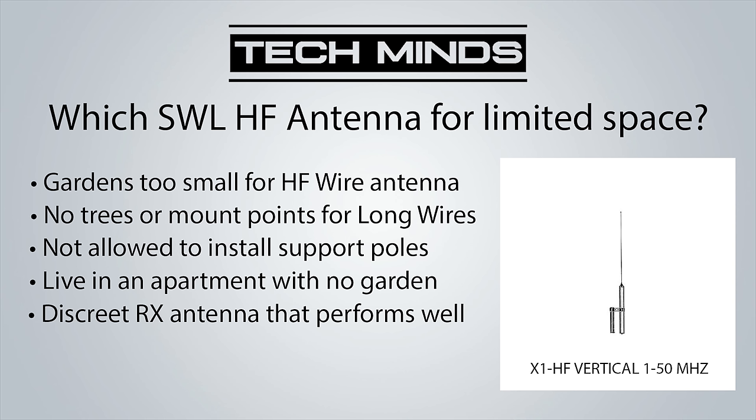For example, you could have a multi-band end fed half wave that would be 20 meters in length, and it would be made up of a transformer at the feed point and then 20 meters of wire. Something like that could potentially cover multiple bands, say from 10 meters down to 80 meters. You could then also get a beam antenna, which the lower the frequency, the larger they get without having to strap on intrusive loading coils.